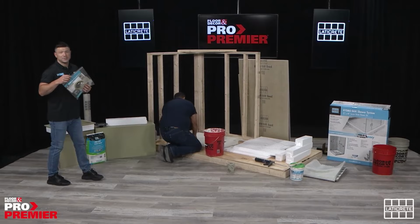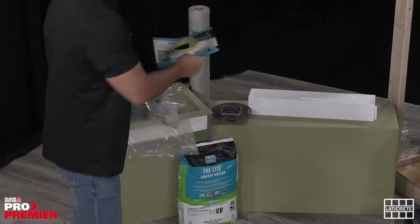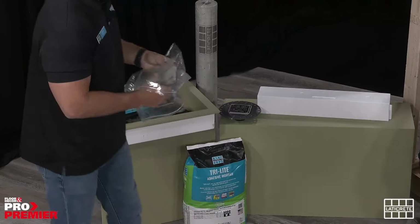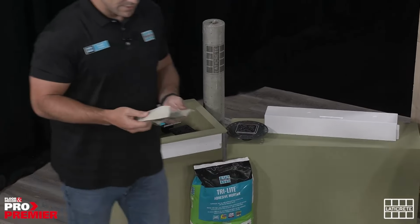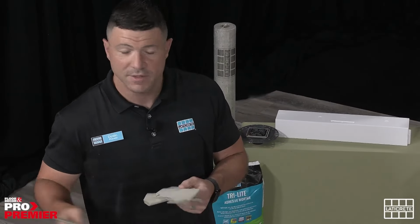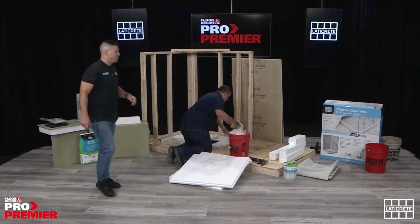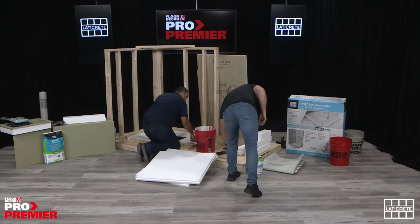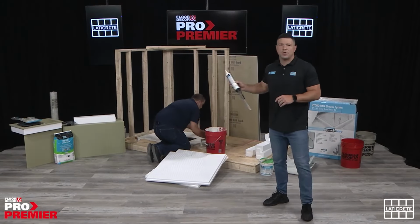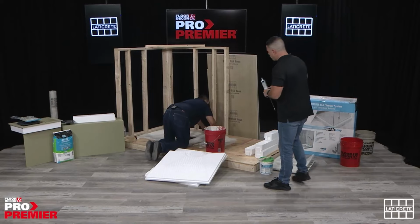each kit comes with some extra bells and whistles. So we have our Hydroban mixing valve seal, our Hydroban pipe collar, a set of two inside and outside corners as well that act and feel and apply the same as our regular sheet membrane. So with a thin set adhered down, it's also going to come with a tube of our adhesive and sealant, which is going to allow you to seal up any coves, corners, and transitions, or stacking of board. So it's very versatile in that, and also seal up nail holes.